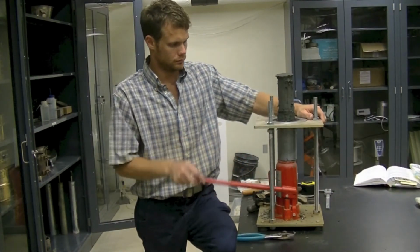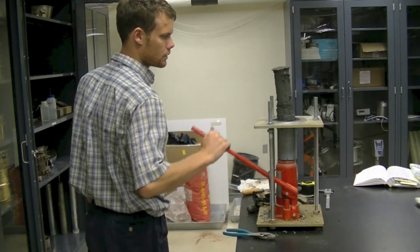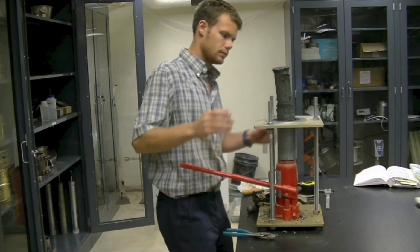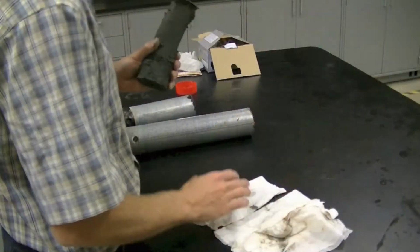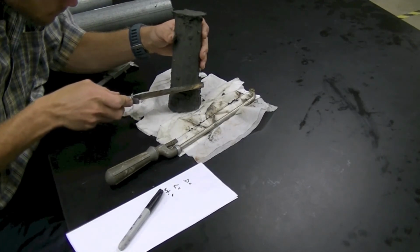It is best to use an undisturbed sample when running an unconfined compression test. Here, a Shelby tube sample is extruded with a hydraulic jack. The jack fully pushes the sample out. Carefully remove the sample from the bottom platen of the jack and place on a flat surface. Trim or cut the sample as necessary.